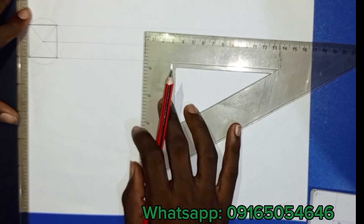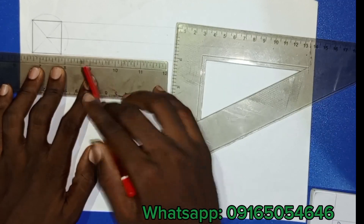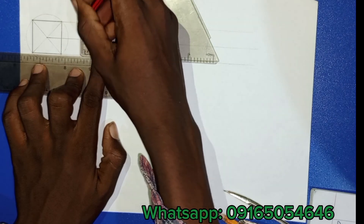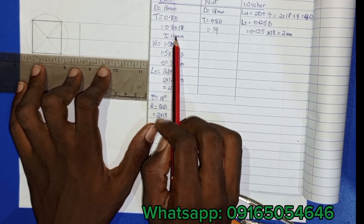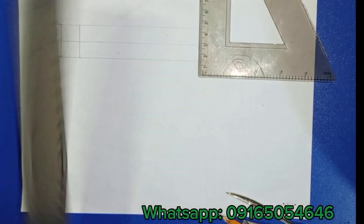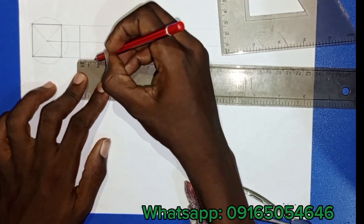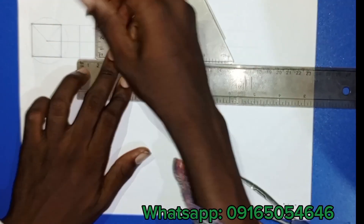I need to move a reasonable distance from the square — not too much — and then draw it straight. With our thickness given as 14 millimeters, I'll measure starting from that line — 14mm. Then with my set square I carry it up.